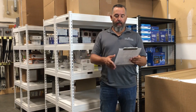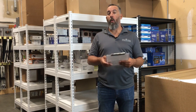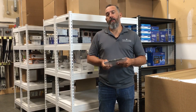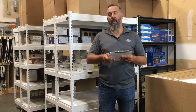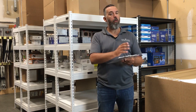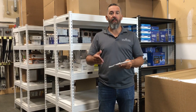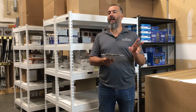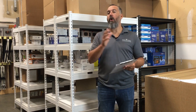Well, Donald, let's think about what are the implications of going with welding wire. First of all, welding wire is not color coordinated — it only comes in black. So you're going to be wiring basically all your main distribution with black wiring, and that's going to be confusing later down the road if you have other technicians or boat owners trying to figure out what all these black wires are doing. Which one is positive? Which one is negative? And then people might have to rely on the heat shrink. So I'm not a big fan of using black for everything.